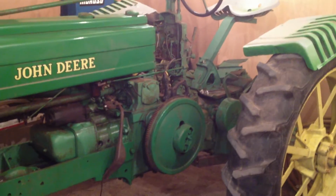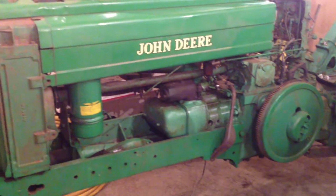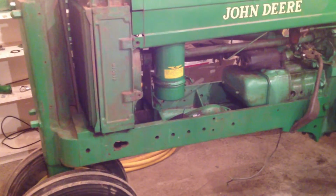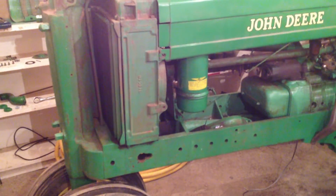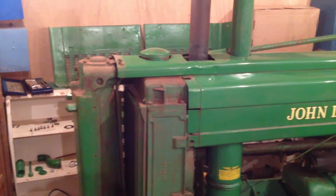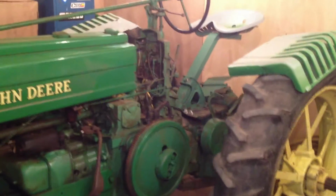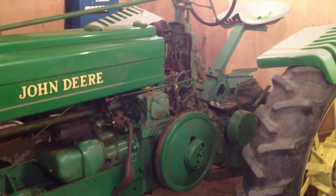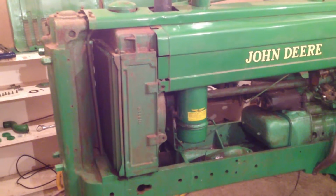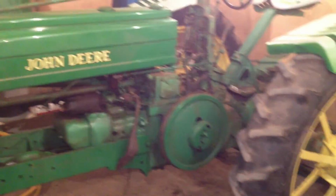These wartime tractors are difficult to date really, because as I say, they were built out of a spare parts bin, what they had available at the time. I mean, it's definitely got the cast iron frame on it, which was fitted during the war years because of the shortages of steel, but it hasn't got the pressurised radiator, which was another thing that was fitted during that time. So they are difficult to date. I don't care what people say on the internet. These wartime tractors were a bit of a bitser, mix and match, I reckon. But we will rebuild it as it is. It is what it is, and I'll rebuild it as it is, and it'll look well.